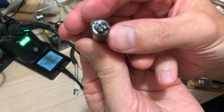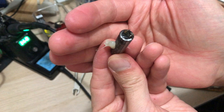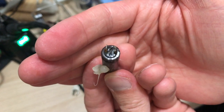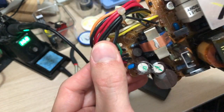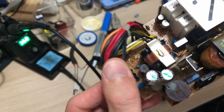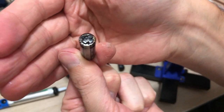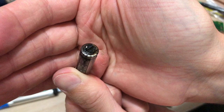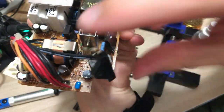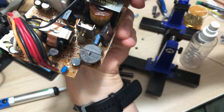I got one of the 1200 microfarad caps off — just look underneath, this is really bad, it has leaked big time. This may very well be causing the problem. It was also hot-glued to the other caps and was pretty hard to get off. We can see the goo on the board underneath the cap as well — get this cleaned off and it'll be like new with a new cap. The 2200 microfarad cap was also terrible, it really leaked. The whole cluster in that corner of the board looked pretty terrible — I wonder if components are especially hot here and that's why they fail.